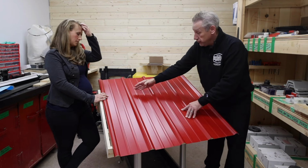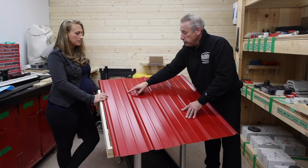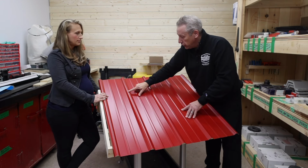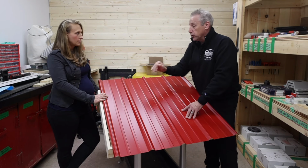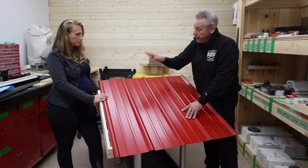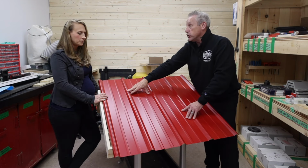Yep. And then if you've measured it and you pre-drilled your spot, you know where the hole is. You're not finding out where it is. But what happened there basically is that, if you pre-drilled it, fine. If you don't, maybe better. But you're going to put on the closure, which we'll go through in a second. Then the cap. And then you go through the cap, the closure, the sheet, into the wood below. And that's how you finish that part off at the end.